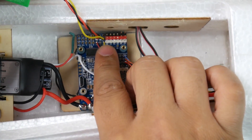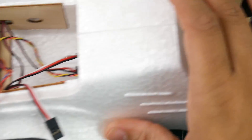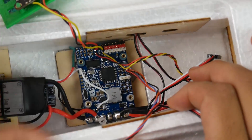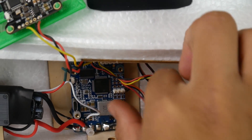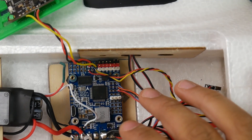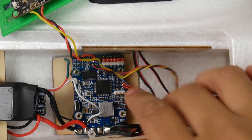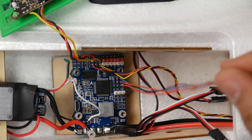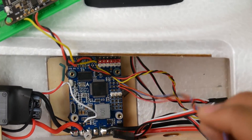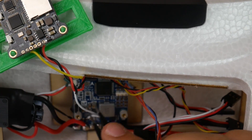The VTX is connected at the edge — VTX ground and 9V on the bottom right there. On the other side is the camera connection, and the camera wires go along the wall all the way down to the cameras as shown earlier. For the GPS I've set it up on UART6 — I just have good luck with that setup, the plane usually flies really great. Here's the GPS connector which came with the GPS unit; it's really long, which is great, and they are silicone wires — Matek uses premium stuff.